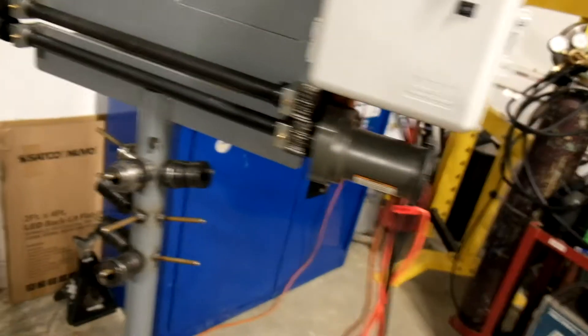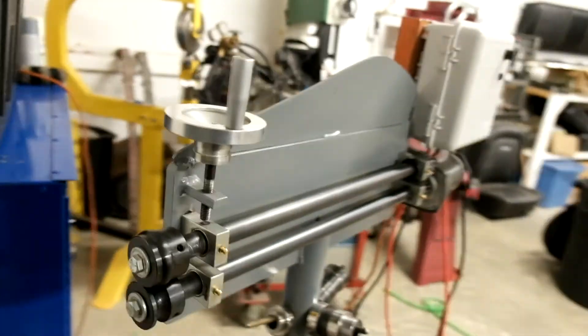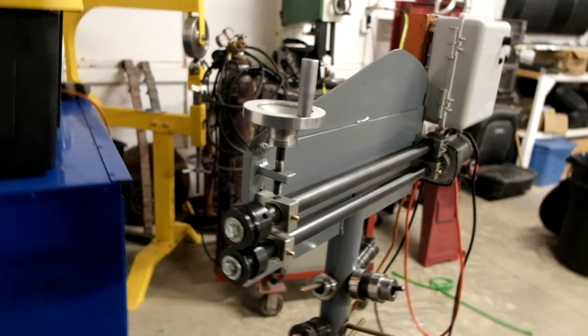Anyways, this is it — quick little video. It's mounted, it works awesome: on, off, reverse, rheostat, foot clicky switch — it works. Rolling beads, making parts. The handle is off of a mill I had laying around. For any more in-depth stuff, check my other video — I'll link it up top or down below. I'm super happy with it. For the price, I think in the electronics and everything — the motorized side of it — I probably have around 120 bucks in motorizing it. So it's not bad at all, totally doable. There are 110 different ways to motorize these things; I'm not sure what the best way is, but I know this way works really well. The reason I went with a winch motor is because it's a small motor and high torque, and it runs through material no problem.